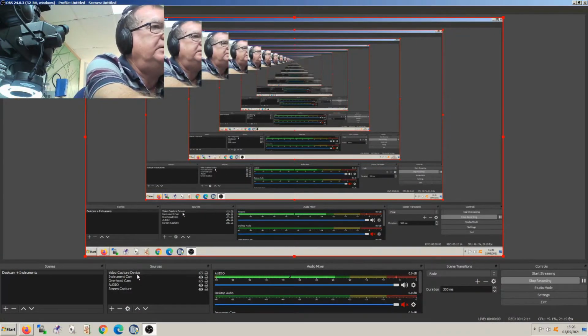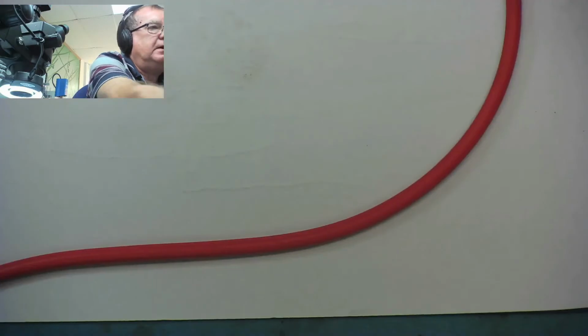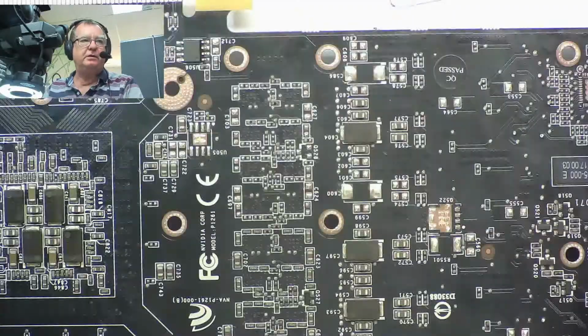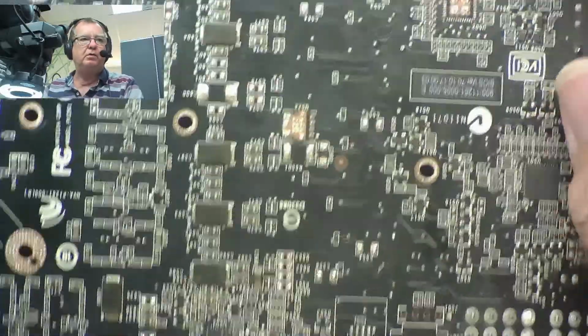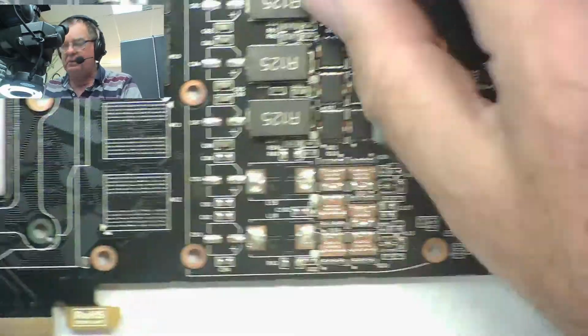But why has it gone bang? If it was a short on the output, that would make a lot of sense, but it seems a bit strange to have done that when there isn't actually a short. It's just like 10 ohms, which is a tenth of what it should be if it's 100, but it still seems strange to me, unless when there's more power, more current flows.